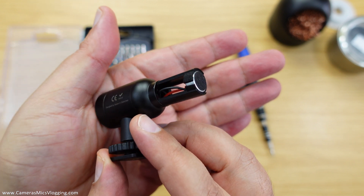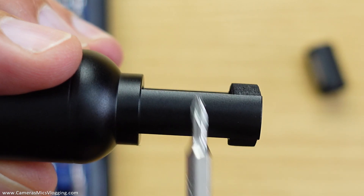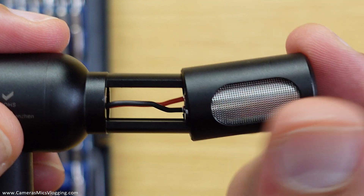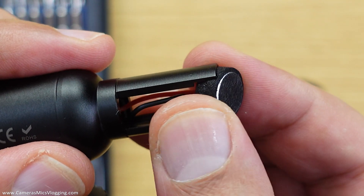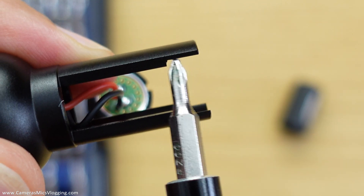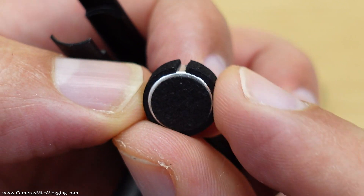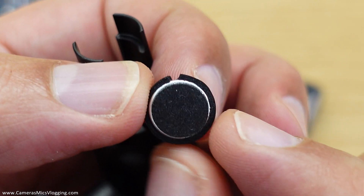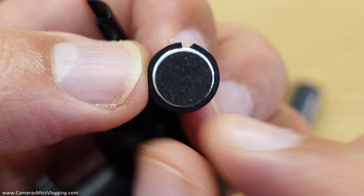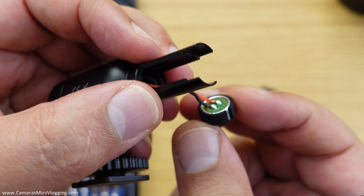Inside we can see the capsule on the end. The cool thing about this body is that this part and this part are metal, and that just holds the actual capsule on the end. When you put the end back on, that holds it into place further. If you squeeze it out a bit, you'll see it's got a slightly recessed top and bottom — that's so the capsule can't move backwards further down the inside. The capsule also has a little foam thing around it. You could strip that off and put it on the capsule you're going to install instead. That's how simple it is to get to this part.